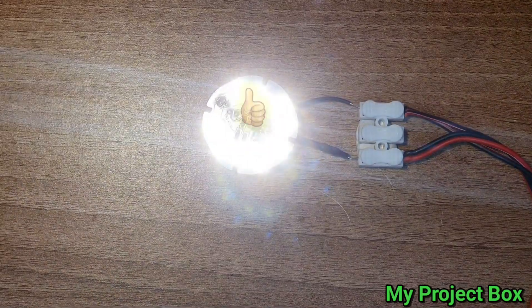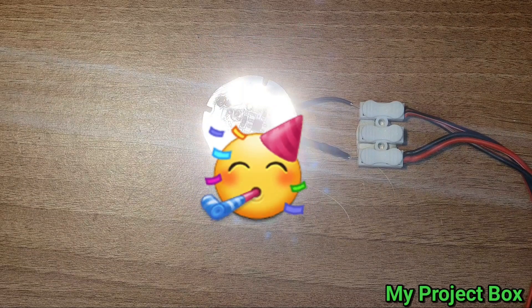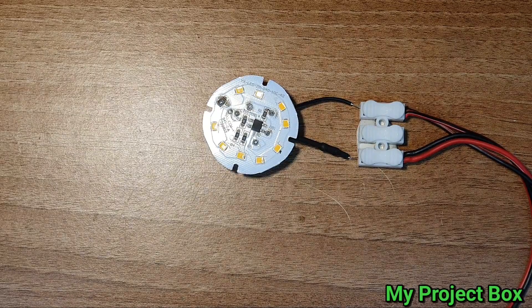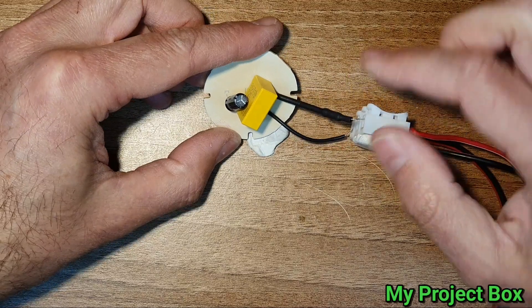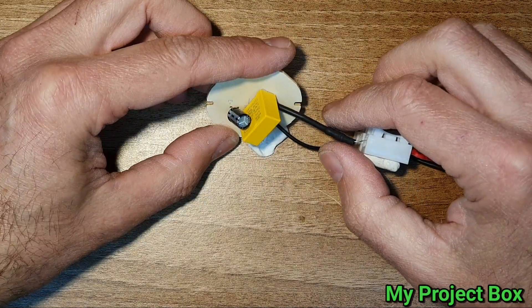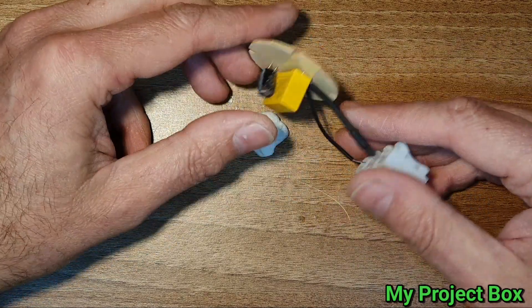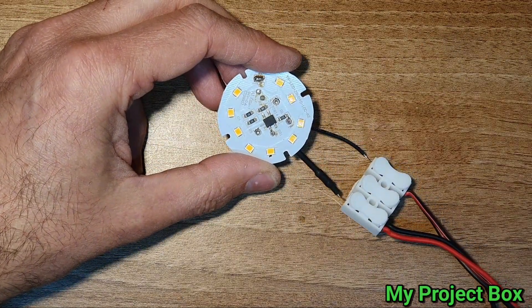Let's see if it now lights up. Contact! So there we go. That was an easy fix, but we want to try and prevent it from failing again. So I think what we need to do is lower the currents of the LEDs to give them a bit longer life. So if we change this limiting capacitor - this cap dropper - to a different value, we can keep the brightness a little bit dimmer, hardly noticeable, but increase the life drastically.